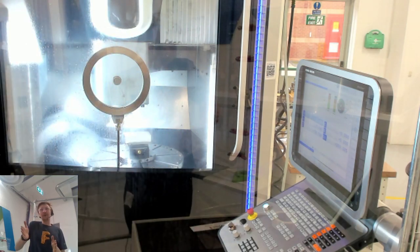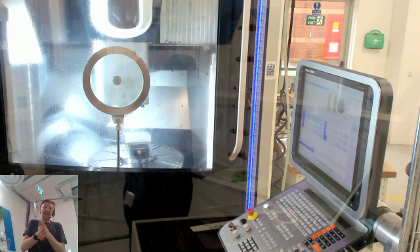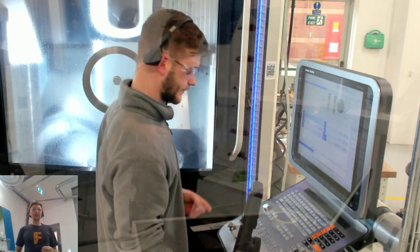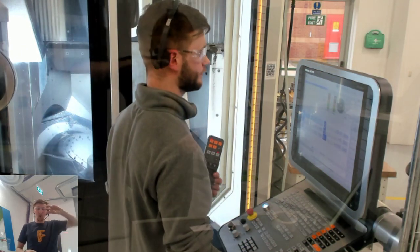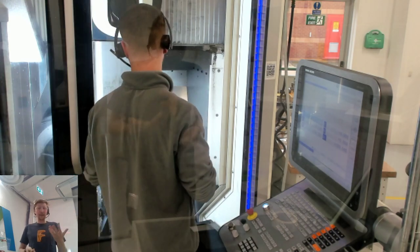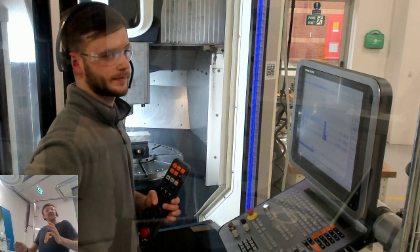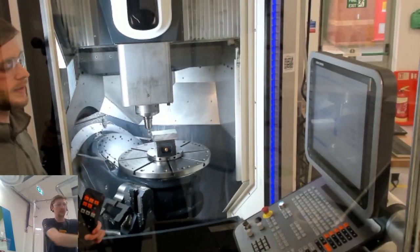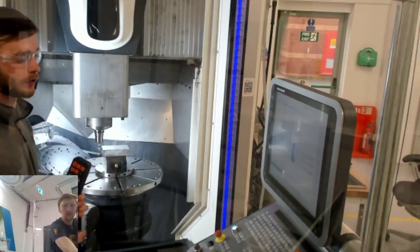So again, we showed you using a probe, which was our best case scenario. Then using a calibrated tool, and we're going to keep working our way down in different levels. So Dylan's just ripped a slip of paper off his setup sheet. And he's now, most importantly, going to rotate that tool backwards and feel with that effectively a slip gauge, but just a piece of paper, see when it grips. So go on, Dill, you can do that. Step to the side, and we can hopefully see what's going on. So, again, it's very much like the slip gauge process. It's incremental. You've got to move it in tiny little increments, keep turning it, keep feeling it until you find that biting point.